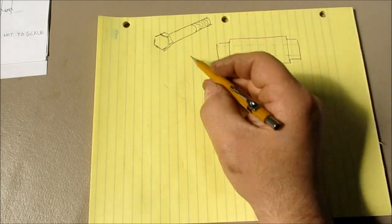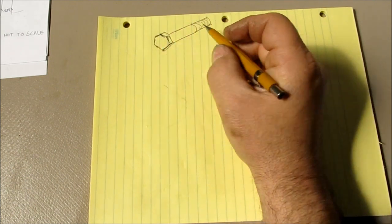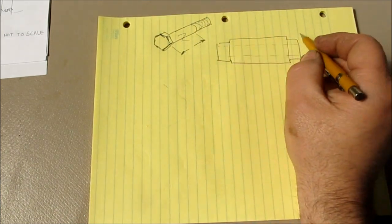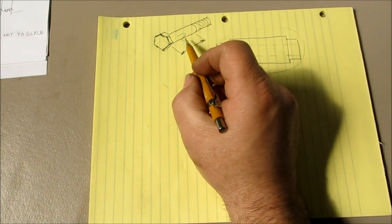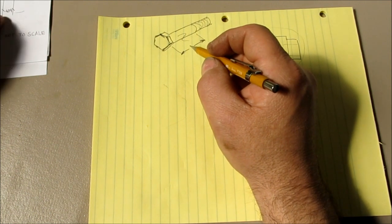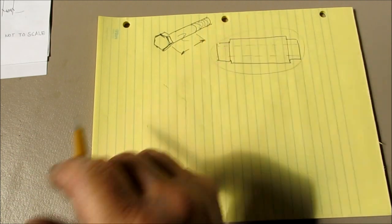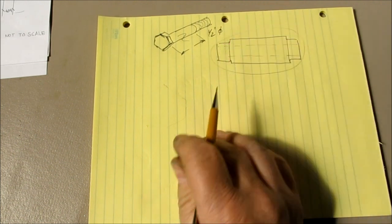Okay, so I'm going to give you the part number for this, for a hex bolt that looks kind of like that, right? And then you're just going to chop out this straight section here, and that's going to become this part right here. Now, that bolt, it's a 7/16 diameter roughly that he needs. I couldn't find a 7/16 bolt in brass that had a straight shank on it like that. So this one is actually half inch diameter.